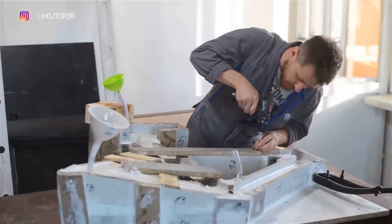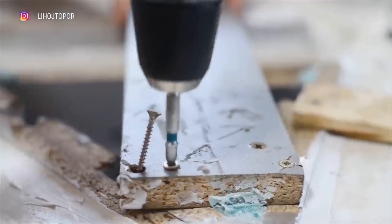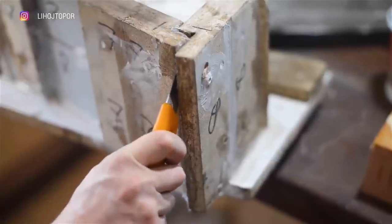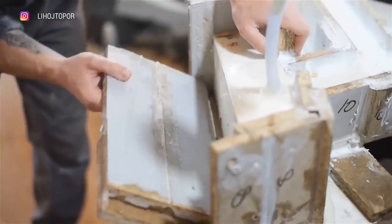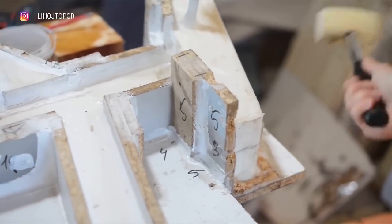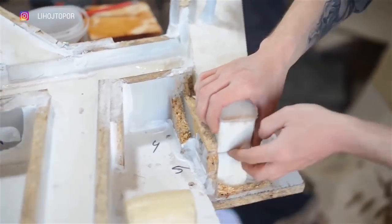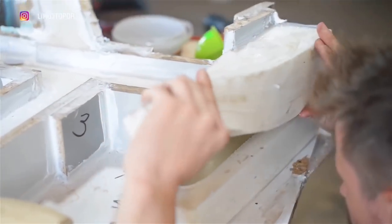After seven days, we disassembled the formwork — but everything is not so simple here. We didn't connect the two parts of the silicone mold to each other in any way, and it's clear there was a little excess resin between them. We understood that this would be the case, so we made the entire formwork airtight. The excess resin should have spilled slightly into the formwork, but since there are no voids there, the resin had nowhere to go. The small volume was enough to embed the formwork tightly, and no matter how much I wanted to save it, I had to resort to more drastic methods.